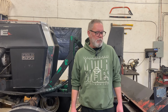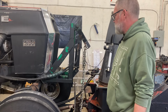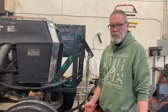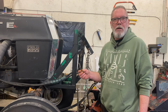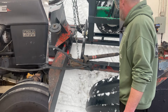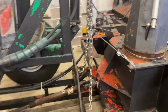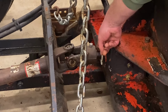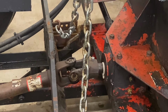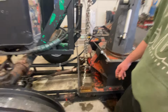At one point in this adventure, our diesel-fired coolant heater quit working on us, but now that's working again. I think that was probably just a simple airlock in there, and it was overheating and tripping out. Anyhow, got it out, got it working, got it up to temperature, the same temperature the gauge has always read, incidentally. And my shear pin for the snowblower rattled out, and it was a real close call. It stopped blowing snow. I got out to see what was going on, and this yoke was working its way off of this drive shaft. I got there just in time to stop the engine, and then it fell off. That could have been really bad, I think.